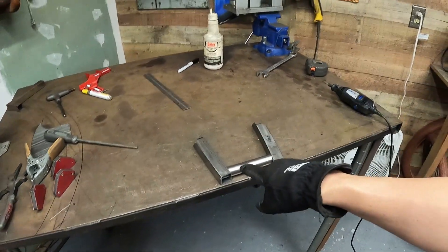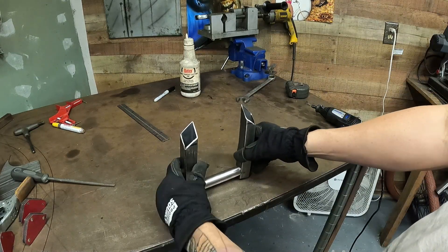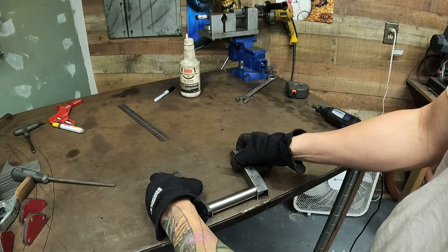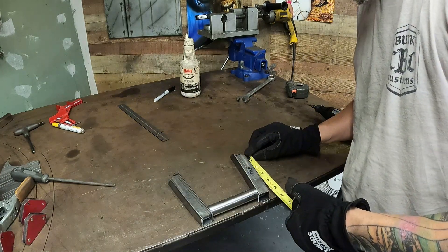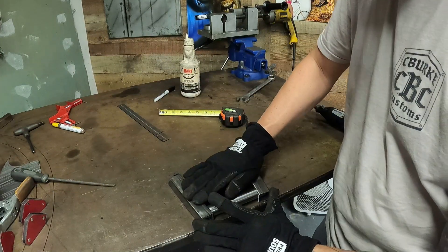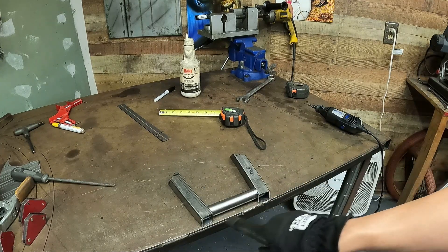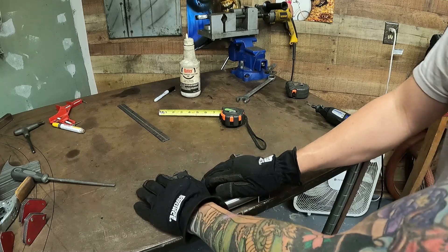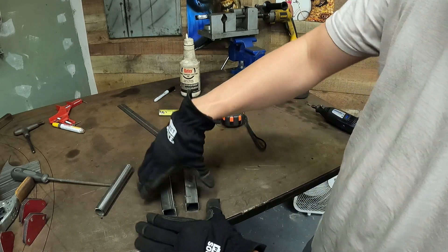All right guys, got the holes drilled — you can see through the bottom that these are inside of there now. I'm probably going to do something cool with them: instead of having them go straight up and down, I kind of want them to do a little bit of an outward tilt. The way to check it — put it at the end of a flat area and measure from here to here to see if that works. Coming from here to the bottom: five and a half, five and a half. Looks pretty good. Before you do any welding, go ahead and cap these off because it's going to be hard to grind the welds off the cap once they're on. I'll put them where I want them, cap these off first, weld that, clean that up, then stick everything together.